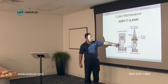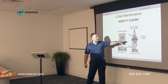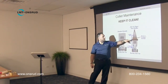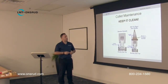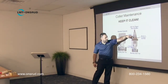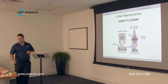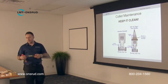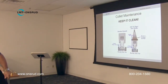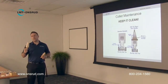It's extremely important to try to keep the collet and nut clean — make sure all areas of the collet are clean. When you break down that tool holder out of the machine, you sometimes get a little resin buildup on the back of the taper where it slips into the spindle. You want to keep that area clean as well as the face of the collet nut. We do sell different sized brushes in our accessories catalog to clean out the collets — they're just brass brushes, so they're not very abrasive. Those are used for cleaning collets and also for cleaning the inside of the spindle.